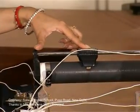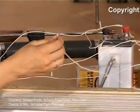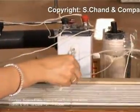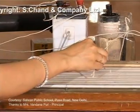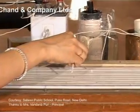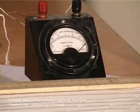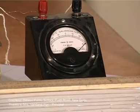The rheostat is already fixed at a particular position, giving a particular amount of voltage to the wire. Now let us try to determine the null deflection point. Since there are 10 wires, we cannot go step by step through each wire. The basic procedure is to touch wire number 1 of the potentiometer — as seen in the galvanometer, we are having deflection only on the right side, and it is very large. Coming to wire number 2, the deflection is still on the right side.